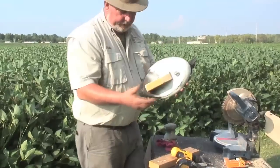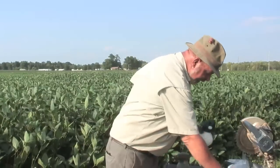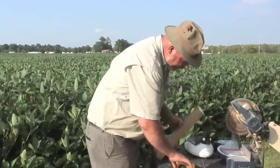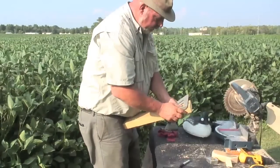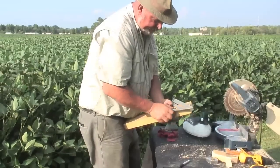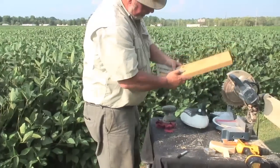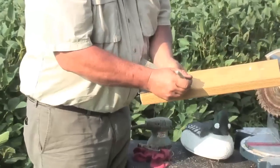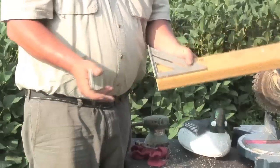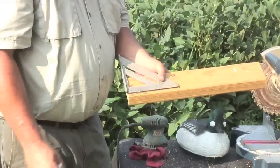And that is how you put a keel in the Traditions decoy. Now I'll show you one more keel design, and we'll glue this next one in just so you can get an idea of how you can make one to wrap. Remember that was a one and a half inch mark. We've got a seven inch hole — or about a six. This board right here is basically a little bit more than six inches, which is perfect. So if I go to the other end of this and mark it right there, that'll give me a place for my chop saw to go. Here's your six inch mark — that's about six and three quarters. Perfect.